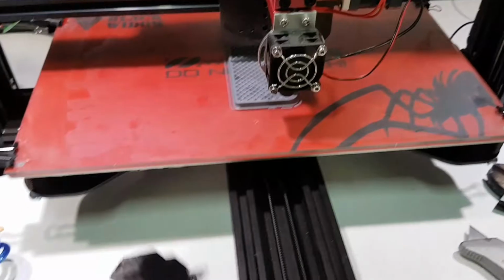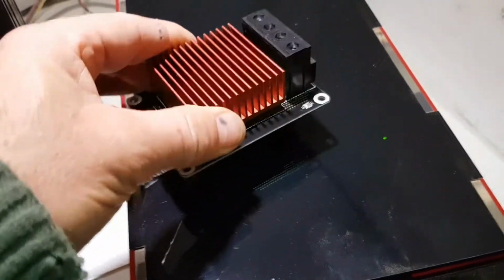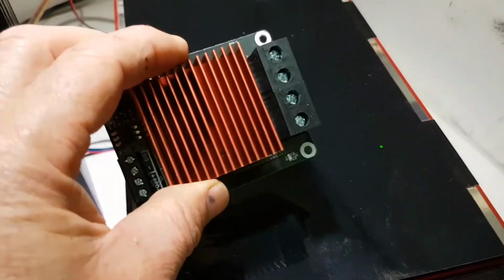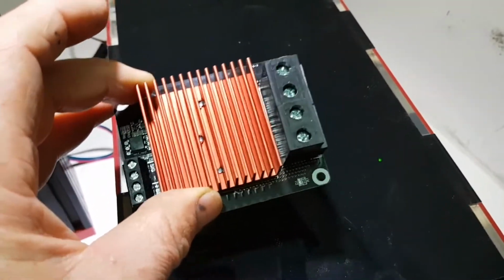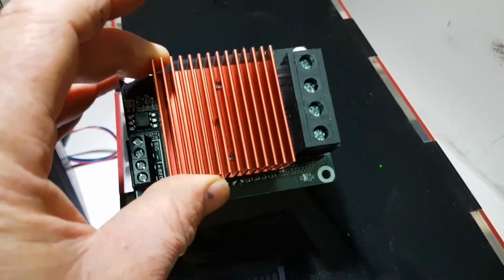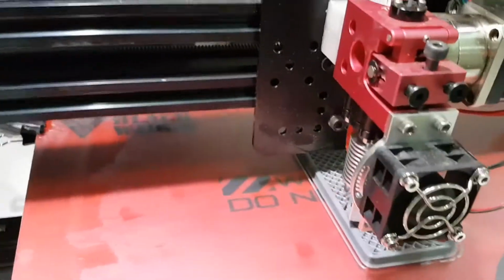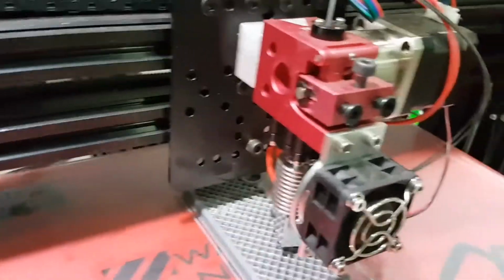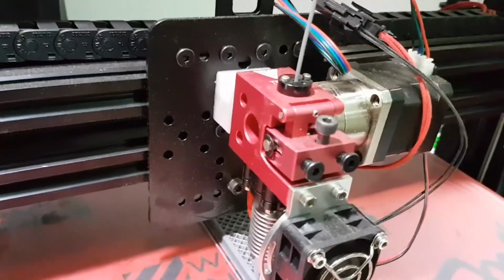The other thing that is a bit annoying with it, the wiring length would basically put this unit somewhere either inside or outside this control box. Now I can't see any valid place outside the control box to put this. Yes, so there was instructions given as to how to wire it in, like in the wiring sequence, but not how to protect it or mount it or whatever. So it's a bit of a shortcoming there in the way this is done. I was also given, which I can't spot right now, a sensor for measuring the height, but there was no bracket supplied for actually mounting it to the back plate on the x-axis.